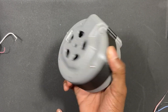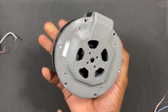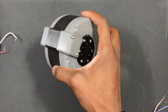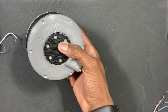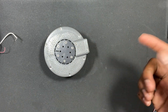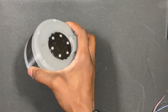Version four uses an ESC rather than a motor driver, and I used that with Arduino. I was having a lot of problems because an ESC is mostly for flying planes — not an actual motor driver. I also used an optical encoder: a 3D printed wheel with a bunch of holes, using an Arduino optical encoder to sense the degrees that it's turned. That didn't work too well at all.